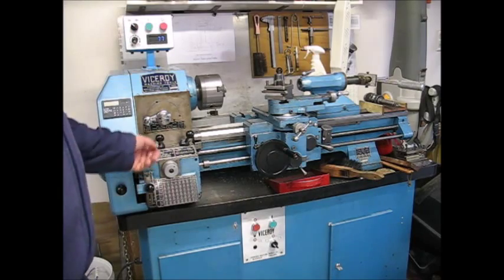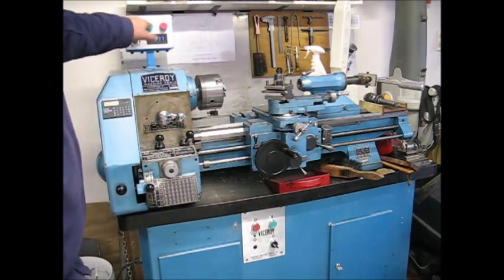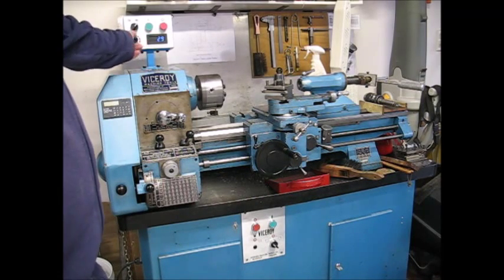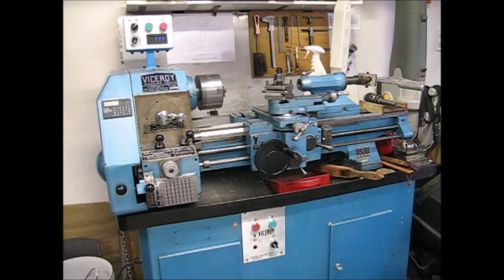Press stop. I'll put in the back gear. Press run. The RPM is a very, very slow 8 to 10 RPM. The speed ranges from right down at about 30 RPM all the way out to maximum speed with the back gear in, at about 370 RPM. Very constant speed with the variable speed drive — so that shows the full scope of the control.